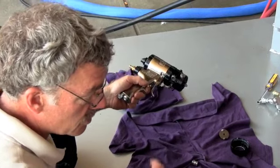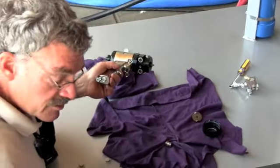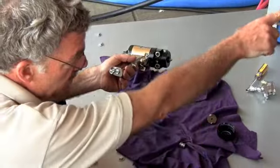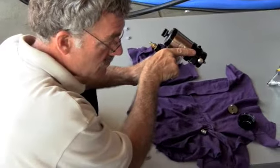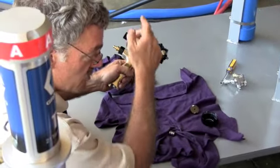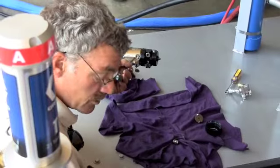It's going to be rising up. If it gets too light of a color, you're getting more of the green drum and less of the black drum — this is a darker substance. Plus your gauges on the machine are going to go out of whack. Because the pump's trying to pump through, it's going to hit a clog, and the pressure's going to start building higher than the other side. You'll see it on the gauges, and it'll tell you which side you have a problem with. Usually it'll be the A side.